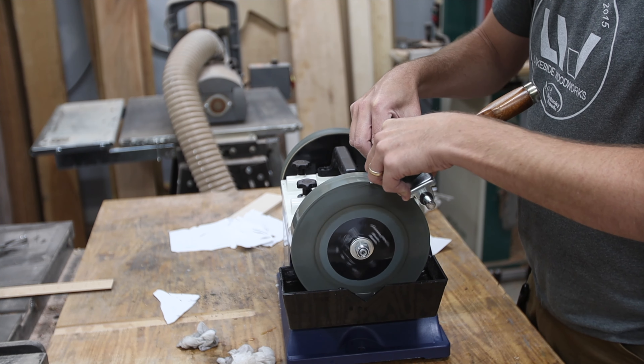I've done this one a little bit already so it's just about ready. I'm going to grind it a little bit more and then go to the strop. Once you are done grinding and you're sure that you're done, you can go ahead and remove the tool — or leave it there and loosen the clamps to get your chisel out of the jig. There's a pretty decent burr on the backside and a nice edge there, so we're going to go over to the strop.